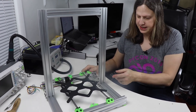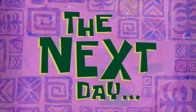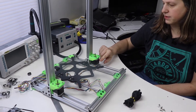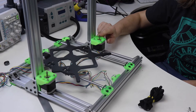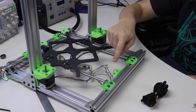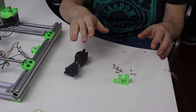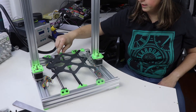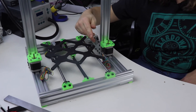The next step is attaching the Z axis motor holders. I've gone ahead and attached the Z axis stepper motor mounts along with the stepper motors and the insert. These are special mounts I had designed to be a little bit taller for these taller motors. Next I attached the Y belt for the carriage — I had to move the Y motor mount over a couple millimeters but it feels like it's in a good position now. I've also tidied up the wires.